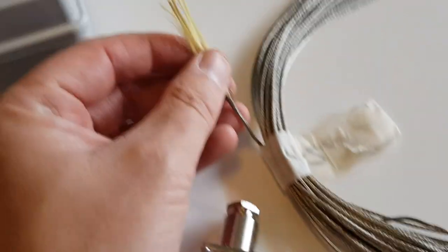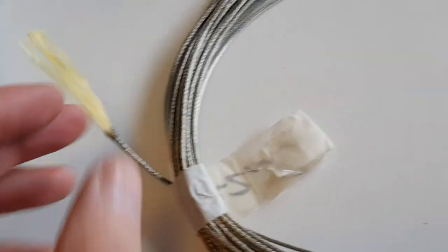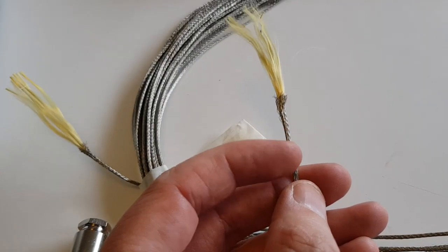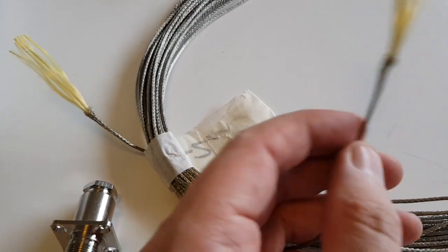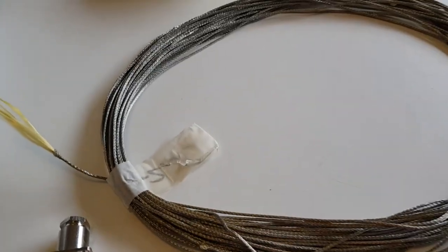This is the wire I used for the Mark II — tin copper with a Kevlar core. It's very expensive, about a pound a meter. It comes with a green PVC coating that you need to strip off, but it's difficult because the wall thickness isn't consistent and the blade can nick the copper wire. It's not ideal to strip, but it does work very well. It's around 1.6mm diameter and is still on the Mark II Adjustable Wave from my first video.